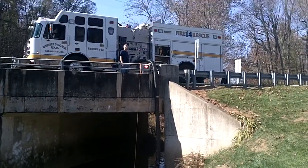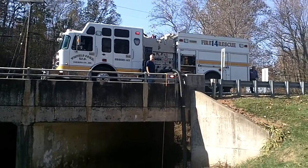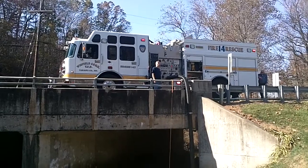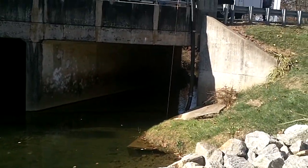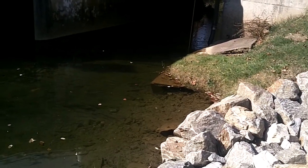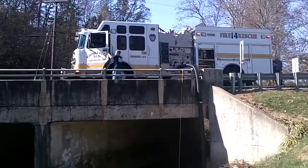We're back here in Carroll County, Maryland with Winfield Community Volunteer Fire Department using engine 142 again. I'm Mark Davis, GBW Associates, home of GotBigWater.com, and we are looking at the Trident Auto AirPrime at what we would call a high lift. We have 3 lengths of 6-inch hard sleeve coming off of this bridge down to a box strainer in the stream. Driver operator is Scott Dayhoff again.